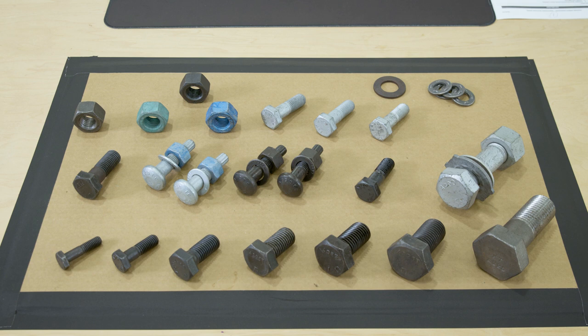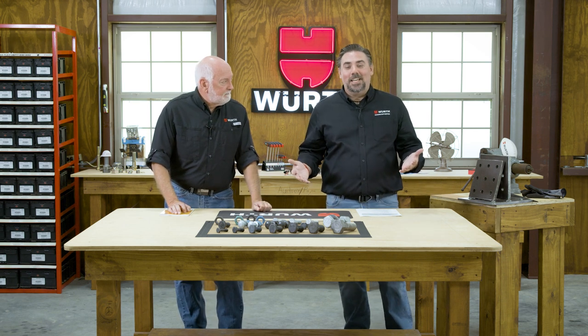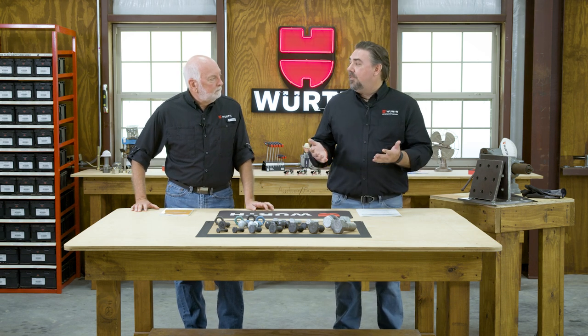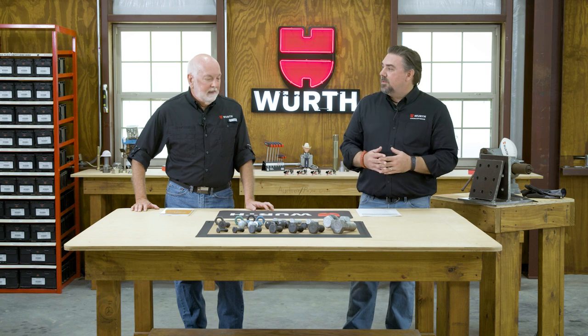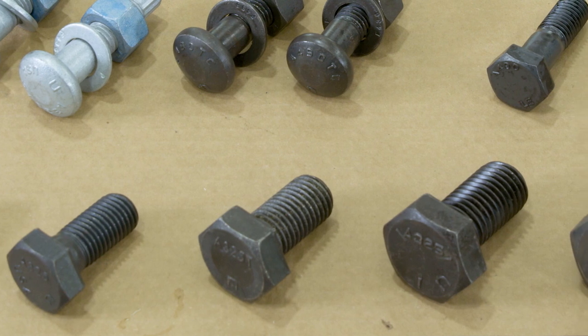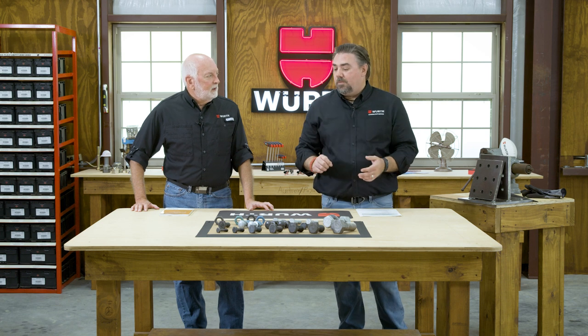I see black and gray bolts here. For your 120 KSI group — the A325 hex head — those are available black, which is plain steel, hot dip galvanized, and mechanically galvanized. Kind of hard to tell the difference between a hot and a mechanical, but the mechanical is going to be a little bit smoother. The best news is it's going to have exactly what it is stamped on the head, so you'll know if it's an A325 or A490 because they're made to look similar, but the difference is on the head.